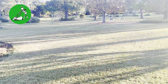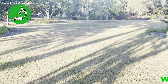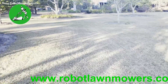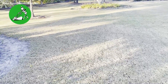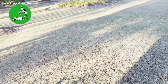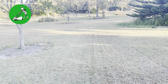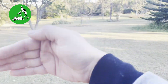We actually split this entire zone up into two areas. The reason for that is because we're running this on a solar system and didn't have enough battery charge to mow the entire lawn every day. So it actually mows in two separate halves — you can see the three tracks going through here where zone one and zone two split, one on each side.